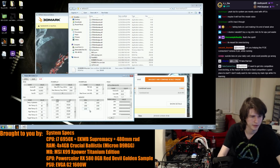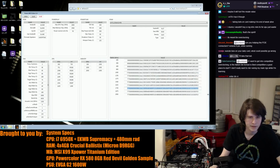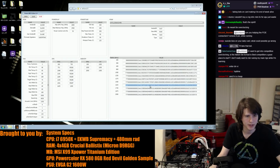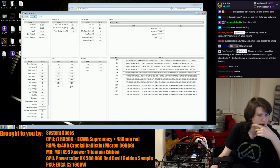We're going to start that BIOS off on, okay, you know what? I want to leave it at 2000. But let's see about those memory timings. So that's 1750. Man, those are long. Okay, so that's the one I currently copy-pasted everywhere. I don't think the 1625 is going to be that different. Let's try that. There. Save, and we're going to do it as Pro Rocket. There. I'm going to call that the Rocket BIOS. Save. This is gonna be great.